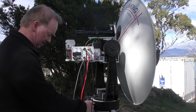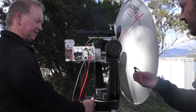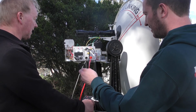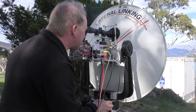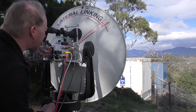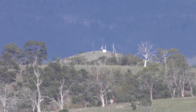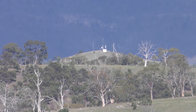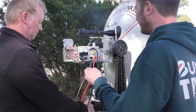So what are you doing right at the moment, Richard? I'm going to spin the antenna around. Basically I need to calibrate to a known location, which on top of Cove Hill is a nice little white hut — in this location it's exactly 232.2 degrees. And that will allow you to find the moon later on. At the moment we can see the moon, but I guarantee you when we try to find it we won't — it'll be behind cloud or something like that. It's always the way.